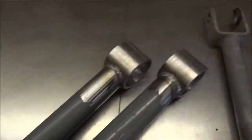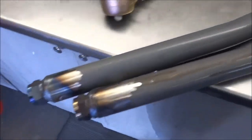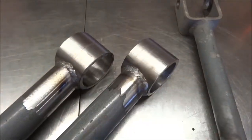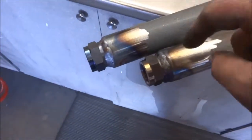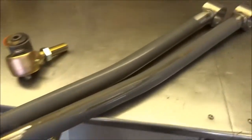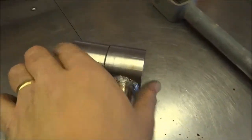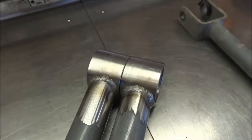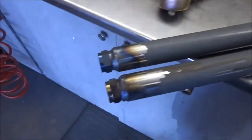This way I saved myself a few feet of DOM tubing for another project. These I know already fit. Why bend new tube when I've already got the bends? Just lop off one end, weld my machined sleeves on, then on the other end measure it out, lop it off. I drilled a couple of holes 180 degrees apart straight through for rosette plug welds, and the other ones I burned in good all the way around. Both are done and they line up perfectly symmetrically — right down to the angle — just off my cheap little makeshift fixture.